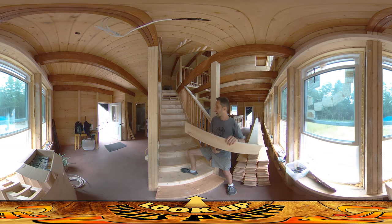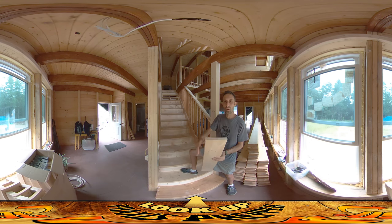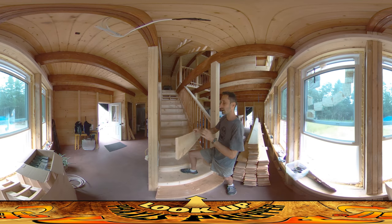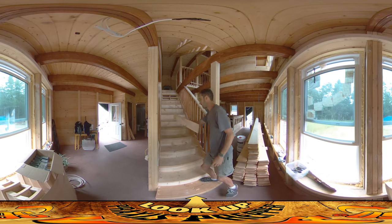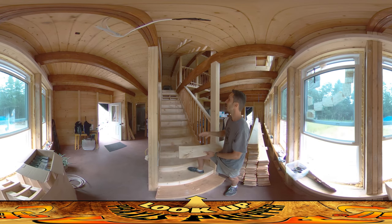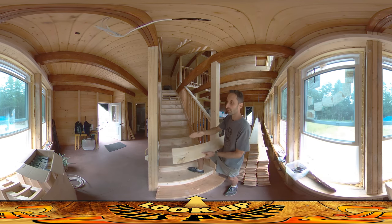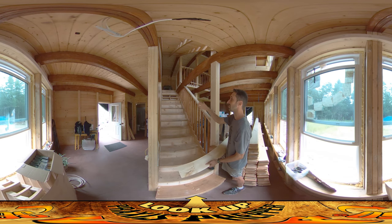So as I've been putting these in, they're not all exactly the same size. What I did is I started with these a little bit wider — I've cut them on all the dimensions except for one. You'll notice I've kind of tapered them; this is the front surface and they kind of taper this way, so when they're sliding in there's a little bit of give and it fills in the space a little nicer. I started with the larger ones, cut one to be a little bit wider, and went along feeling where it could fit in. When I found the place, I'd stick it in, nail it in, then go back and get another one cut to the same size. If I could find a place to fit it I'd put it in; if it was too big I'd go to the table saw, set it down just a little bit, cut the next one smaller, and keep doing that until there's no more that can fit and I have to adjust the saw down just a little bit more.